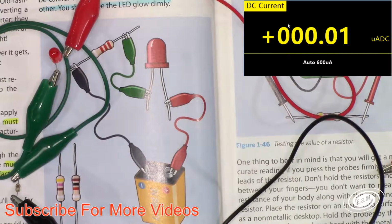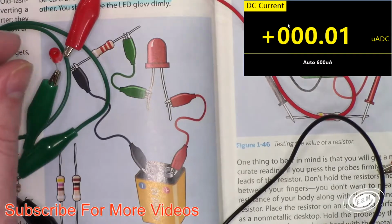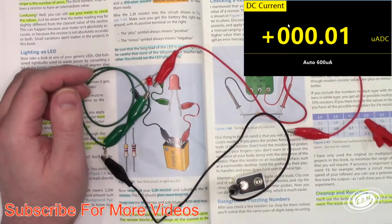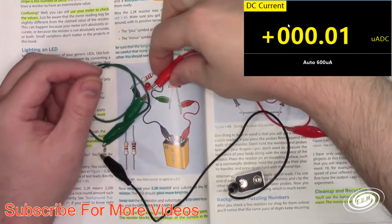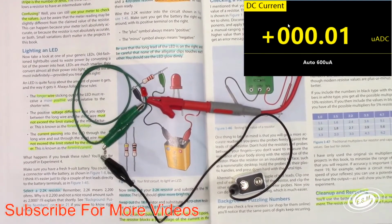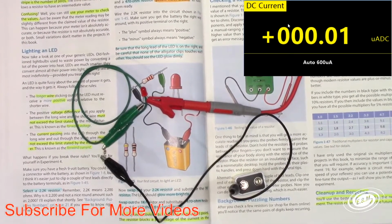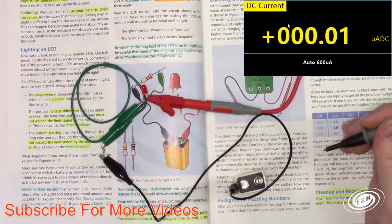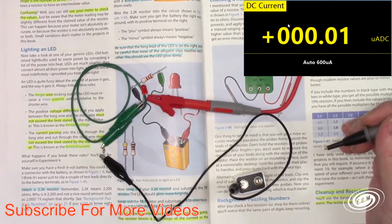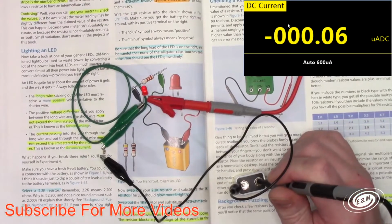So now we have amps showing here, and I am going to replace this red clip here. Let me just go out a little bit so you can see what I'm doing. I want to see what the current is through the circuit, so I'm going to replace this positive lead here with the positive side of my meter, and then I'm going to put my probe on the other side so I can touch this battery and we can see what the current is. Make sure I'm on current. Make sure that I am plugged into the right port. I am. It is reading current, and let's do this.